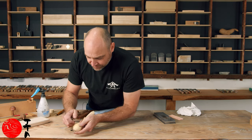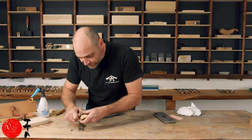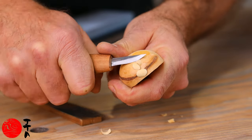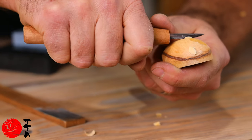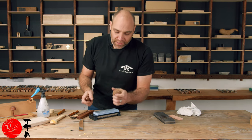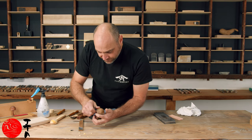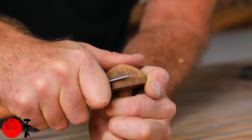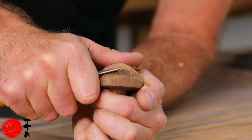Do some test cuts, and we want to see a nice polished finish — no lines, no timber lifting. I'll show you on this bit of myrtle, which is a lot harder and more dense than the huon pine. A sharp knife or sharp tool on myrtle will give you a really beautiful polish.